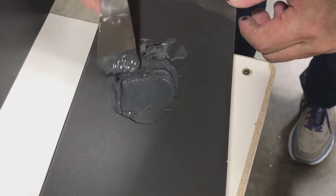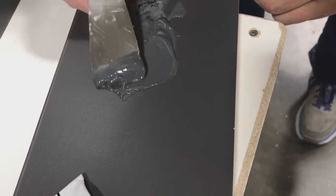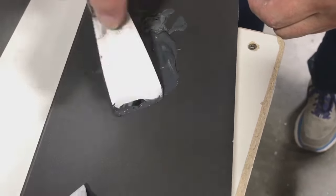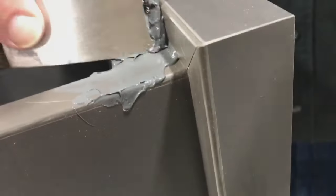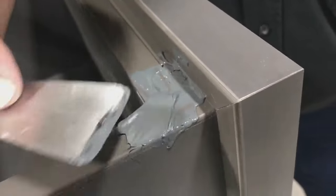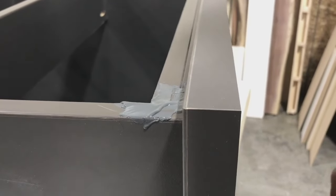There, that's almost a perfect color. Look how that blends in with the product that we're mixing on top of, the actual charcoal melamine. Now we'll just take some of this mix and spread it in our hole here. Whoop. It's messy, but it cleans up with lacquer thinner, like I said. So we'll put that on here like this. And we're going to let that dry really good and hard for about 15-20 minutes, and then we'll clean it up.